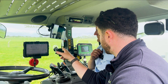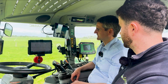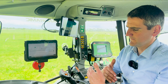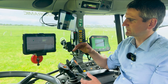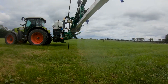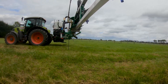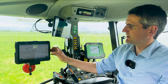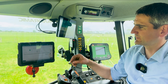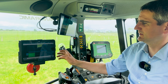There's also range ahead and range behind settings — range ahead is how soon before you reach the plant you want it to start spraying, and range behind is the same distance beyond. There's also a spray threshold setting, which is where you set up the confidence level of the system — we can talk more about that in the next screen.